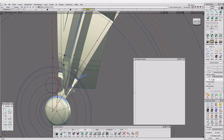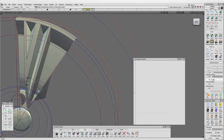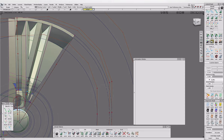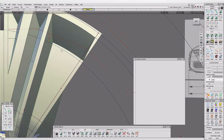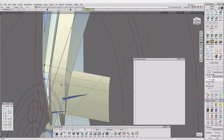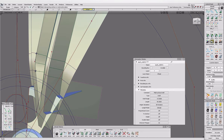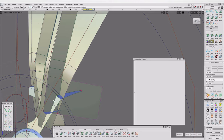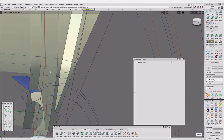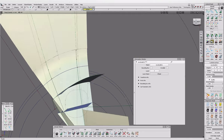And we should do the same for these drafts that I built earlier, for the outer edges of the rim. Intersect it with those back surfaces, and also this revolve, and trim them back. Of course it's not going to work here. Just extend the curve on surface. No, wrong one. Keep. And this surface back here needs to be trimmed to the inner edge as well.